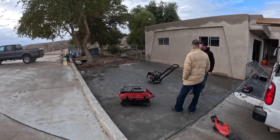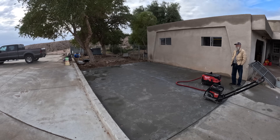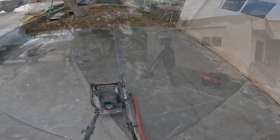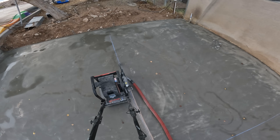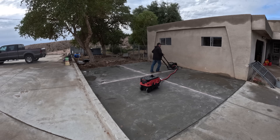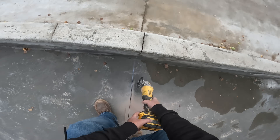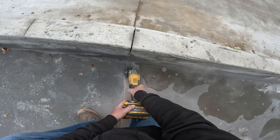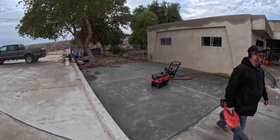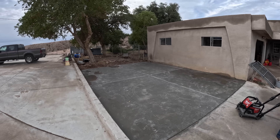Okay, this is not the very next day — we actually waited two days to do the saw cuts because that's how cold it was. We don't want to cut it too early because we don't want spalling and chipping from the blade, so I gave it an extra day. I've got a really nice system here — everything's battery powered, so I wasn't reliant on whether or not Ted was here to supply electricity for all my tools. I just popped the battery in and drove it home. I've got this little four-and-a-half inch Dewalt to finish out my cuts. I'm leaving a very minimal impact on the environment — you can tell by all the steps I'm taking to retain that dust with the vacuum on the cutter.